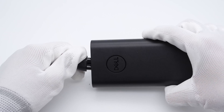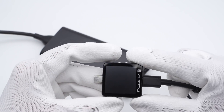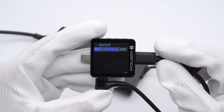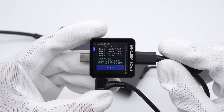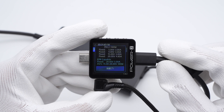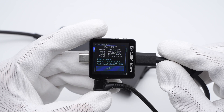The indicator light lights up white when powered up. The ChargerLab Power-Z KM003C shows it can support PD 3.1 and DCP charging protocols. It has five fixed voltages of 5V, 9V, 15V at 3A, 20V at 4.8A, and 28V at 5A, along with a set of AVS.